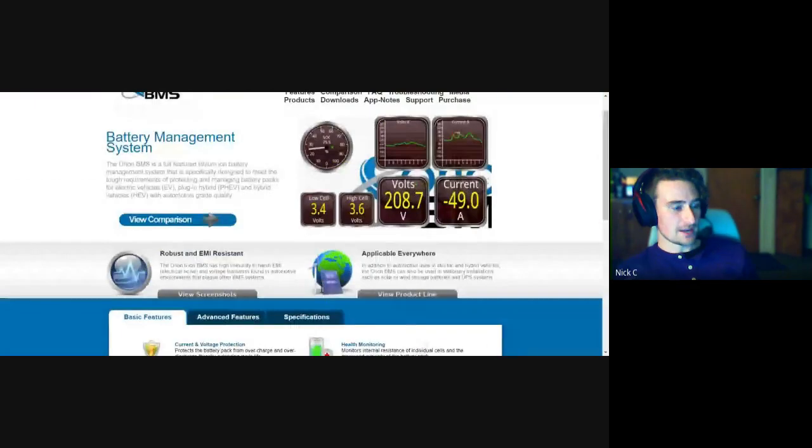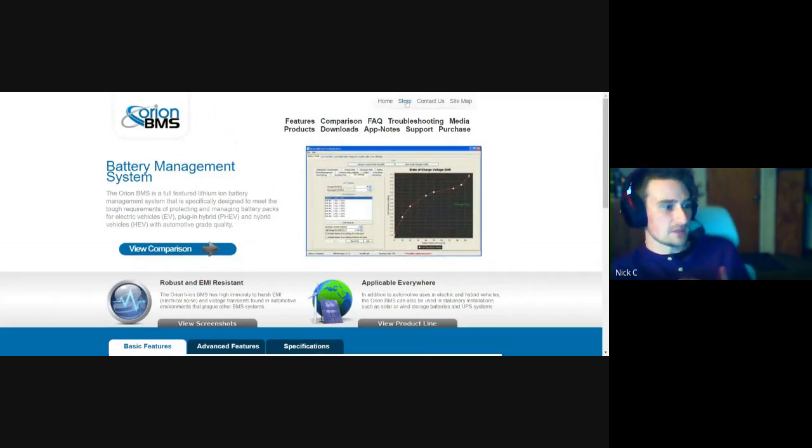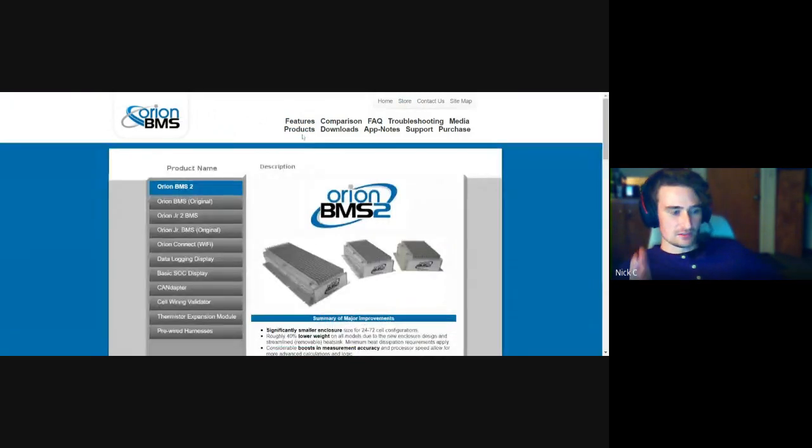Super cool. So is your BMS swapped out with the batteries? Do you have BMSs that live on the battery box? Yeah. So we're running the Orion 2 BMS, and it lives in the battery. In the battery, we have the 14 LG modules, and then we have the Orion BMS, and a maintenance kill switch that will separate the pack mid-pack. Then we have contactors which the BMS controls, that keep both positive and negative from contacting the connector until all the safety stuff is happy. So we have a 12-volt signal and a safety signal that comes from the car.